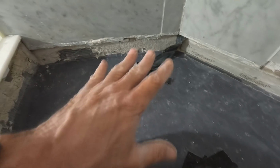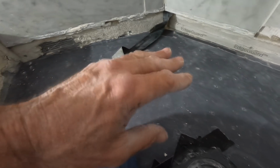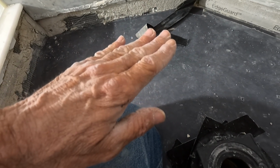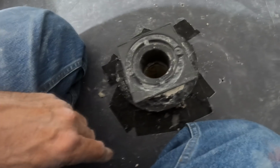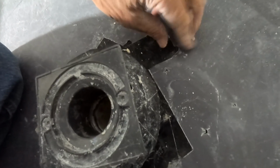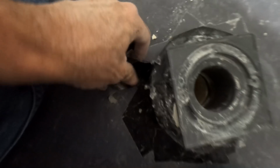If he had only waterproofed the surface of everything, right? That's all he had to do. And all that other material below all the concrete, if he had waterproofed that surface and put the tile on, none of this would be an issue. But it is an issue because, again, in other countries they don't waterproof stuff, but they have a different construction method that has to do with concrete and blocks and a lot of stuff that we don't deal with here in the States.